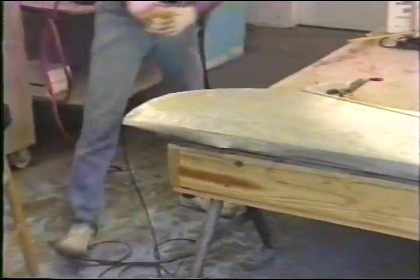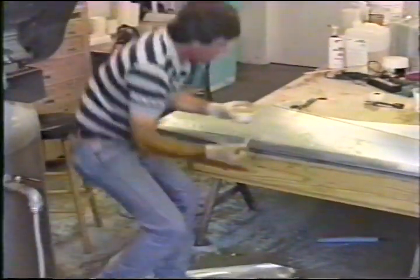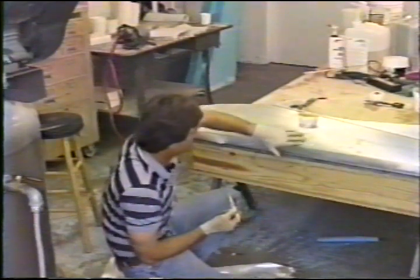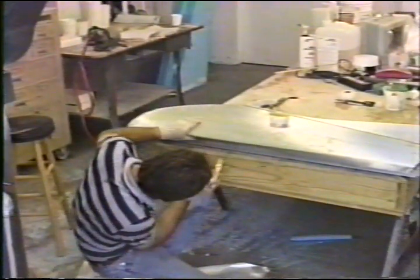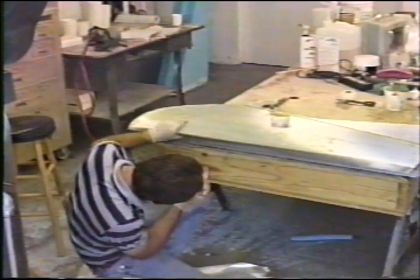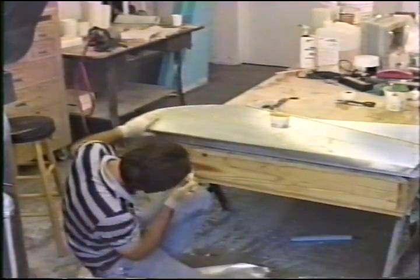We're going to wet this leading edge. The grain orientation at this point runs this way. We can wrap it around in that fashion. We've already wet the leading edges. Tuck it around the corner. No folds. Keep the grain orientation straight.